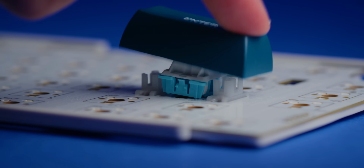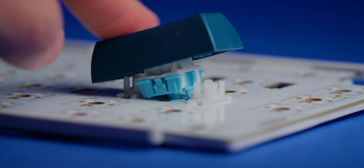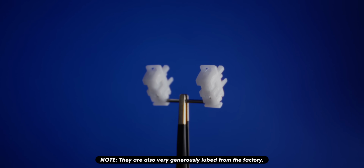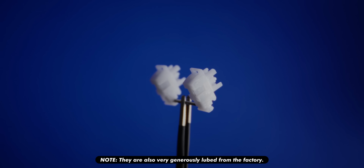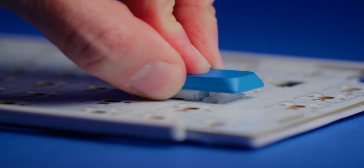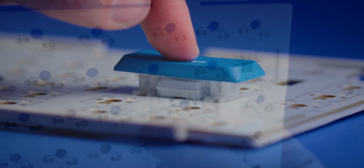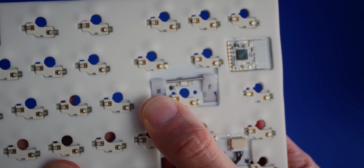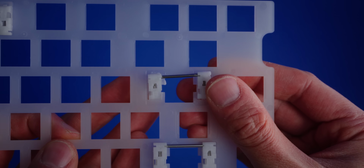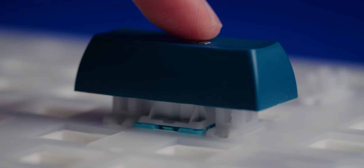Just like with the switches, low and high profile keyboards use their own type of stabilizers. Makes sense, after all, if the switch is taller, so must the stabilizer be, right? Yes, and the way NuPhy worked around this is by designing stabilizers that do both. In the low profile mode, they are clipped into the PCB and look unassuming like your run-of-the-mill pre-built PCB mounted stabs. But converting to a high profile keyboard, you take them out and clip them into the plate instead, thus raising their respective heights just enough to accommodate the taller switches. Pretty nice.